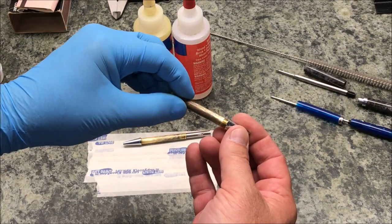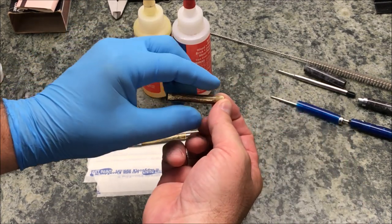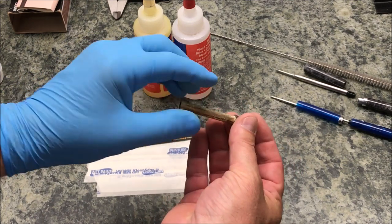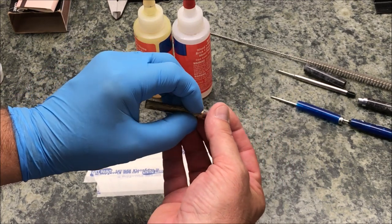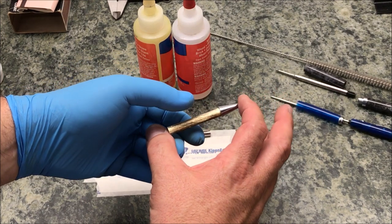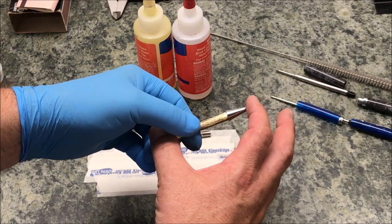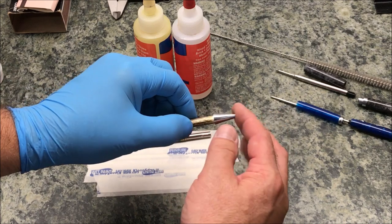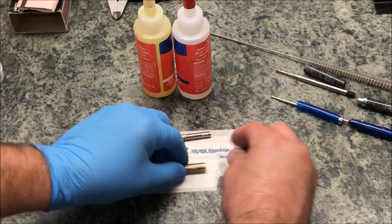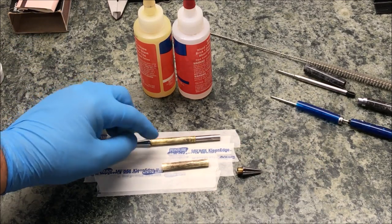This is not a problem — it's got a snug fit, just not a tight fit. What we'll do is first glue the nib onto the tube, then put the blank on and let it all dry together. I may put a clamp on here just to hold it — it doesn't have to be super tight, just something to hold it so it doesn't move. This will fix the problem and the nib will never come out again.